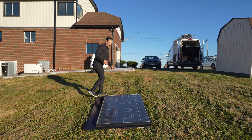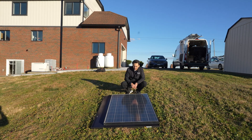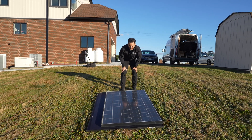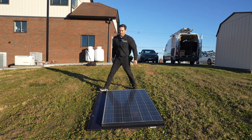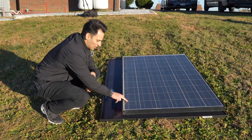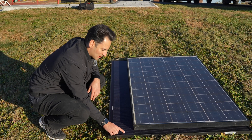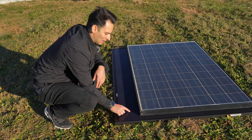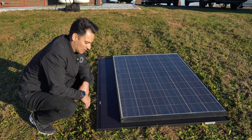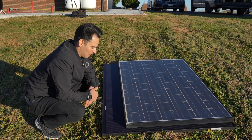It's just amazing to see how far the technology has come. Efficiency-wise, I believe this ET Solar panel was probably 15 or 16% efficient. This REC is 22% efficiency. So cool to see the time difference in panels and the technology we were using back then. You can see the connectors between the cells — here on the old panel it's this ribbon, these two bus lines going across connecting one cell to the next. This REC panel almost looks more like a shingled cell, and you can see the bus lines between cells are smaller — smaller connections mean we're shading less of the cell and getting more production out of it. That's also another reason why newer tier one panels are so much more efficient and productive than panels of the past.